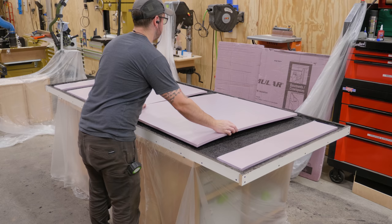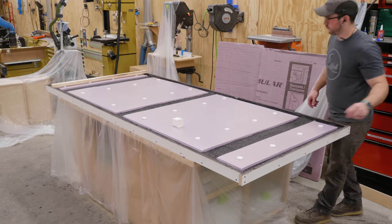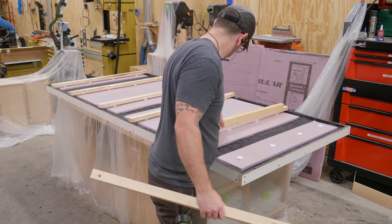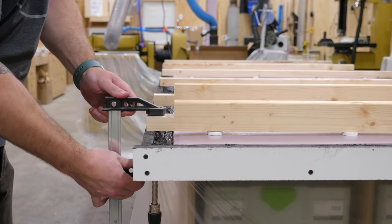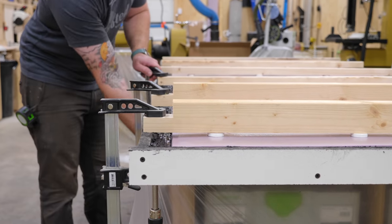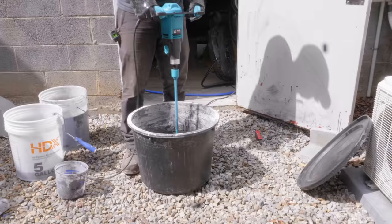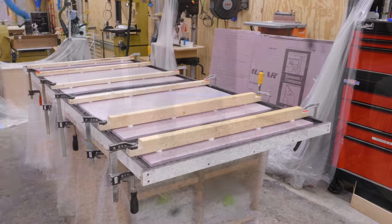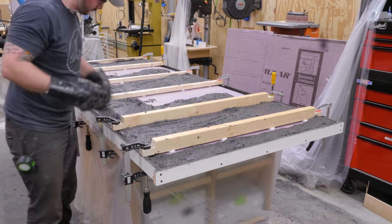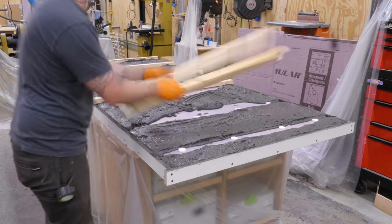I added another batch of concrete to bring the thickness to roughly three quarters of an inch, using the rollers again to smooth everything out, and then I added those foam panels. The panels were half an inch thick, so they sat below the top of the form by about a quarter of an inch. In retrospect I wouldn't have done things this way since trying to cover these foam pieces was a total pain. I 3D printed some quarter-inch thick washers which I could clamp below some wooden pieces to keep the foam from floating, but trying to add concrete around these pieces ended up being really difficult.